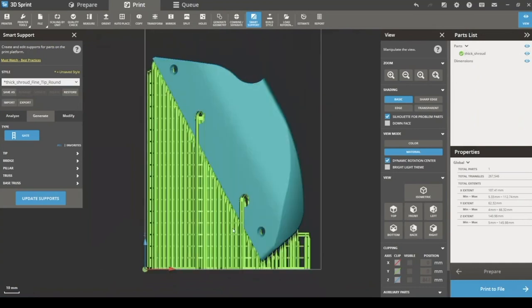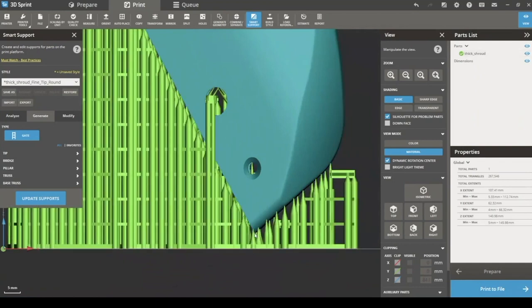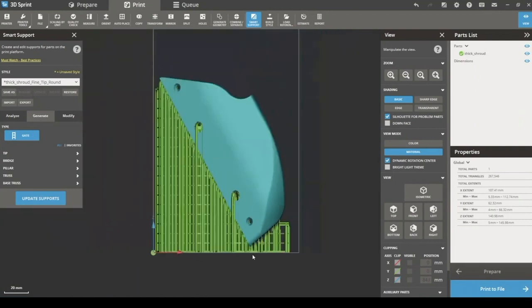And I will say, anytime I'm supporting a part that starts with an edge like this, whether it has a small radius, a large radius, or even a sharp edge as this one does, you really want to go in and be sure that that is supported to where it cannot rock back and forth, which would be to the left and right here. Because as you build this part, you're going to be pushing this down into the liquid every time you do one of your interval moves to raise and lower the platform. And so what you're going to get are some hydrostatic forces that can move your part. And now we're doing this with rubber supports and rubber parts. You really want to be conscious of this here. You still want to be conscious of that with rigid parts, but you really want to pay attention to that. And it's going to move similar to if you take a beach ball and push it into a swimming pool. It's going to want to move left or right. And it's the same type of phenomenon with those hydrostatic forces that's going to want to move your part around.